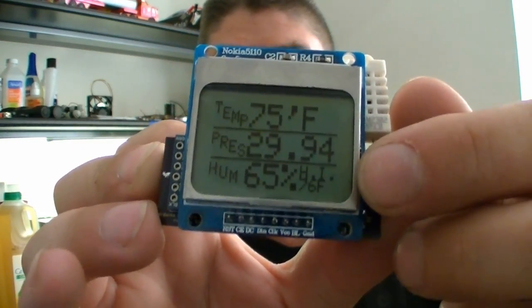As for the Nokia 5110 LCD, you'll see in my code there's a certain section that controls the contrast. I have the contrast set perfectly here — you can't see all the rest of the pixels — and this actually helps reduce the amount of power too. But when I was prototyping, even though it was the exact same screen, the contrast was off ever so slightly and you could start seeing all the pixels, pulling more power and giving a less crisp picture. So when you get your own screen, you might have to adjust the contrast — it's done in the software, in the sketch file for Arduino. Raise the number up a few points to make it darker; lower it down if you're starting to see all the pixels to lighten it up.